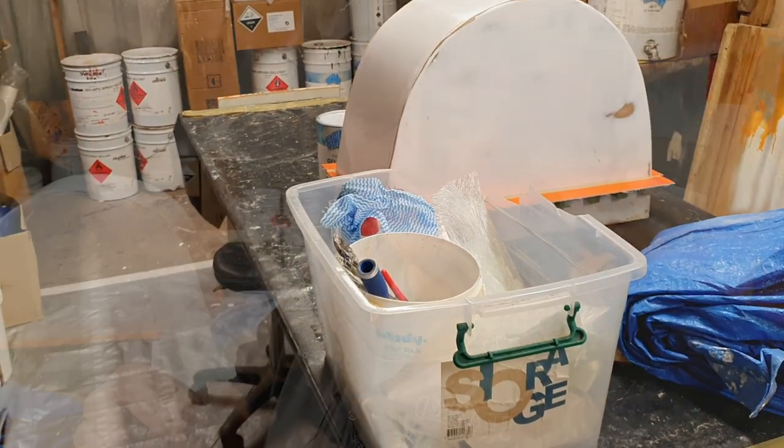Now I'm going to put one layer of 300 CSM on the foam just to let it settle and give it some surface area to bite, and then I'll be wrapping it with a 600 double bias and then peel ply. That's going to be more than enough on top of those bulkheads, because then I'm going to put some slats on top. So ultimately they're not going to be bearing the weight of the tanks. The slats will be. So all I'm trying to do here is get a good seal and a good coverage on top of it. So I'm going to spend the day up there jammed down in that bloody compartment again,